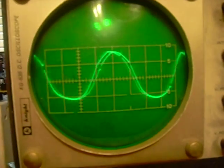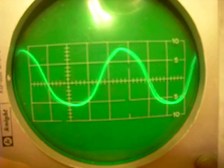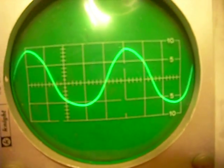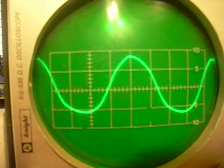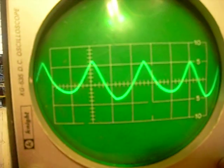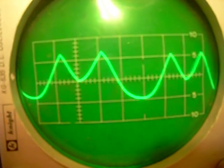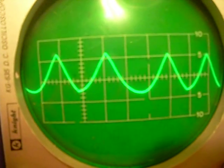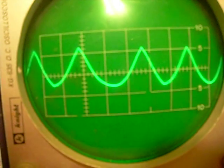Right now we have just a sine wave going through. You can see there's maybe a little bit of noise on there — that's just on the scope. I'm going to adjust the bias. You can see it goes fully one way or the other, and then in the middle you get this kind of half sine-y, half triangle-y looking thing.